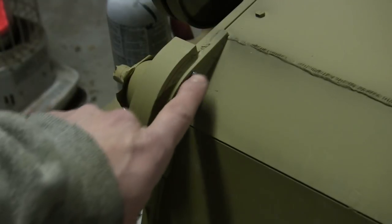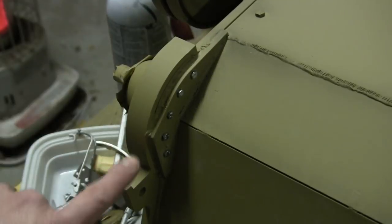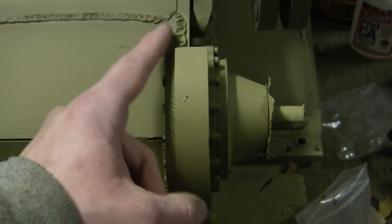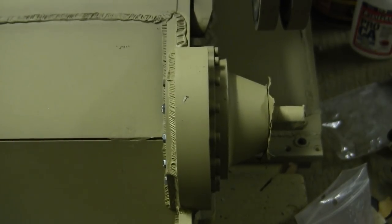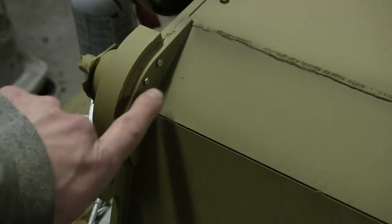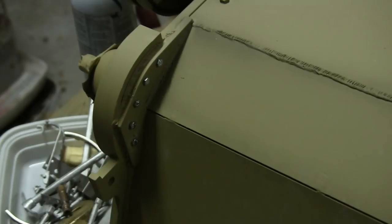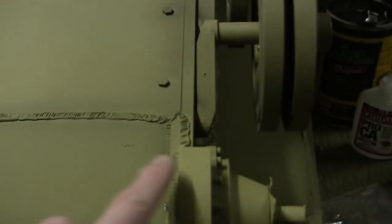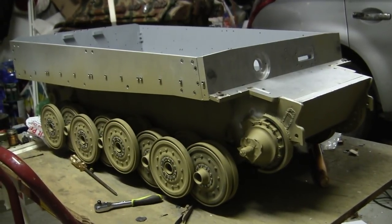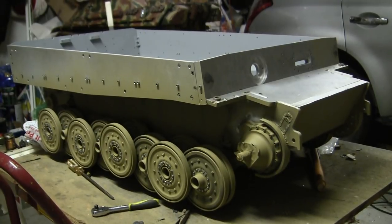I took advantage of the tank's position to mount the securing fasteners to the rigidity strip and reinforcement strip found on the front armored hull. On the Tiger 1 design, because of all the stress in this portion of the tank from the final drive, the designers incorporated a reinforcement plate to be welded to the tank's hull. These plates are found on all releases of the Armortech Tiger 1 and are a nice bit of detail. I took the opportunity, since the tank was on its belly, to permanently add the hex bolts fastened at this location — they thread directly into the aluminum of the armored hull. With the fasteners added to the reinforcement plates, there's no need to have the tank on its back anymore, so the entire tank has been flipped over and will stay upright until the tank's completion.